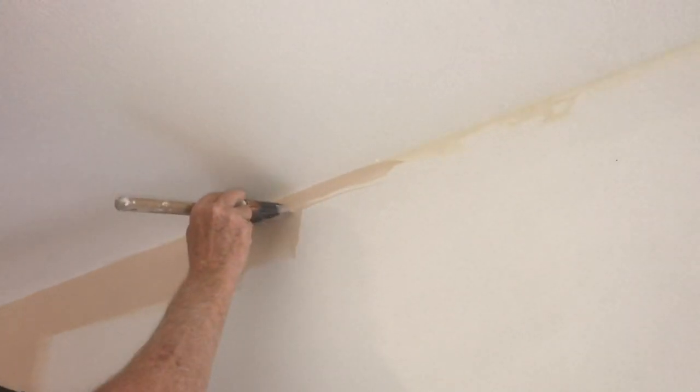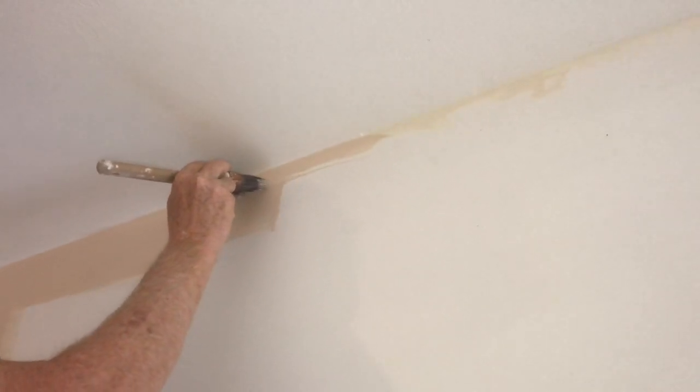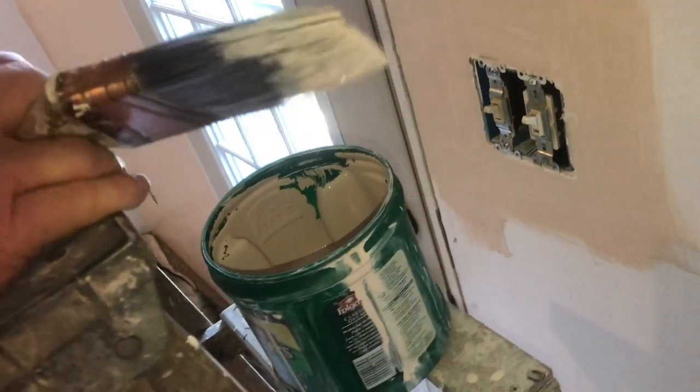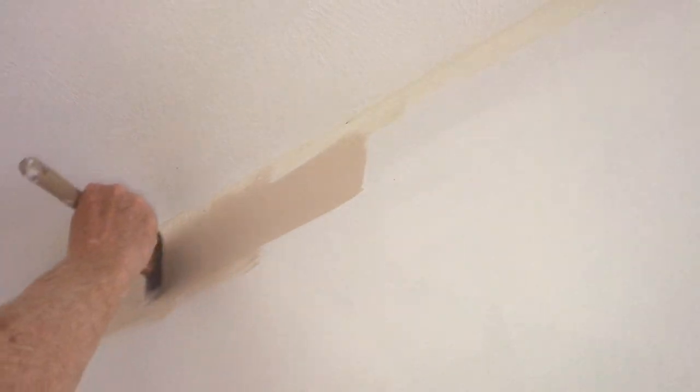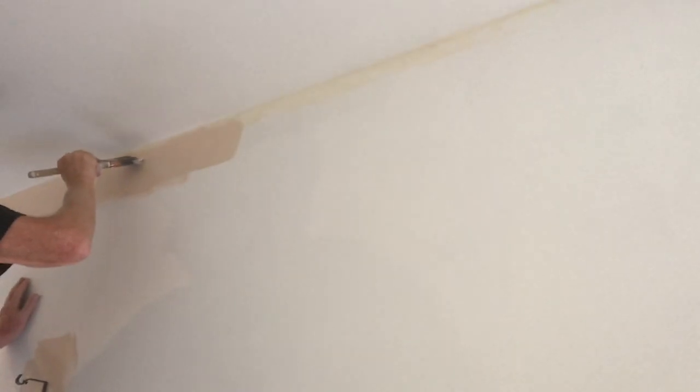When you're cutting things in with your brush, make sure you have plenty of paint on the brush. You'll need to practice to pull a really nice, clean line — once you have that clean line, you can brush it out a little. Sometimes you'll start low and gradually go higher until you've got that line. Using tape won't work that well; it kind of makes a mess and takes a long time to apply. It takes time to develop this skill, but in the long run you'll have a much cleaner job.